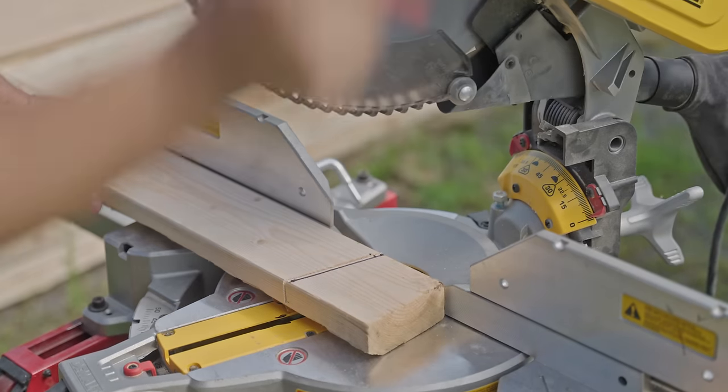This one here is specifically at 8 feet, okay? So this one, I'm going to mark it center. And I'll show you why when we go to put the skin on. The plywood wants to meet in the middle of that rafter, okay? There we are. And of course, the one on the end. There we go. My X is on here.